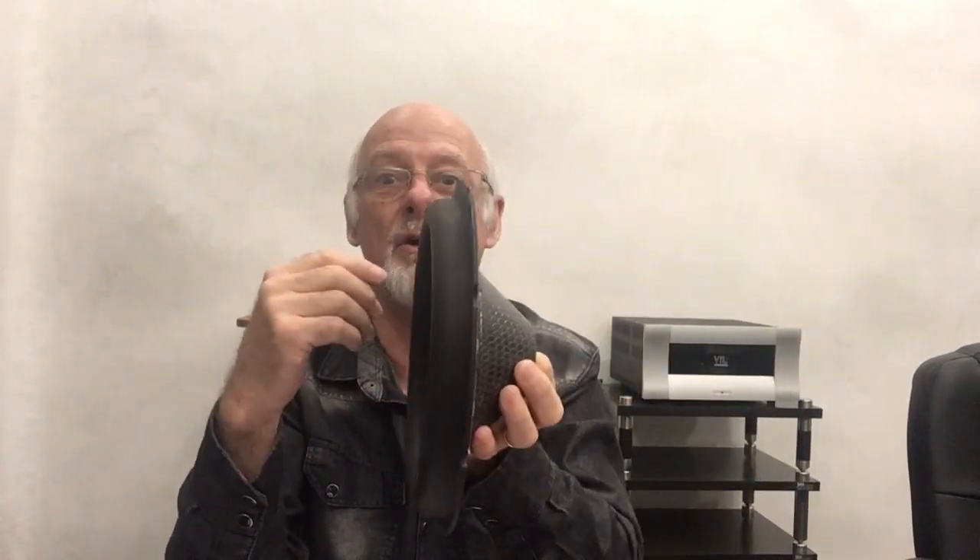So that's one of the big features of what makes speed. We talked about the speed of getting the signal through the amplifier circuit and the filter. And then when we get it to the driver, we want that driver to start and stop instantaneously. If the cone is heavier, it's going to carry on going even after the amplifier has said stop, come back, go the other way. So you want this to be responding really quickly, backwards and forwards. And that's what the light cone does.